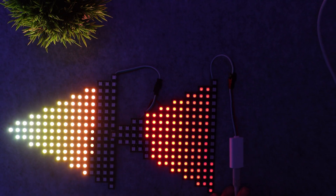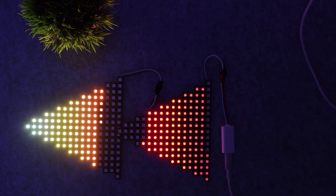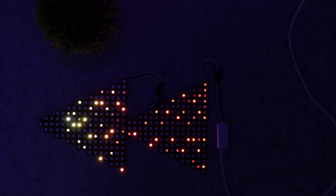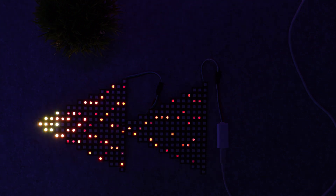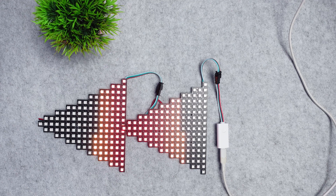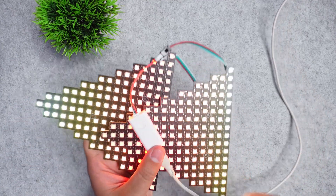There is no internal relay or fuse, so power is passed right through, but this thing does have an ESP32, meaning it should be able to handle some decent lighting effects — although the number of LEDs is limited by how much current your USB-C power supply can supply. I hope to do more testing on this and see if it becomes my favorite LED controller, but since I haven't tested it long enough I won't be including it in my favorites at the end of this video.